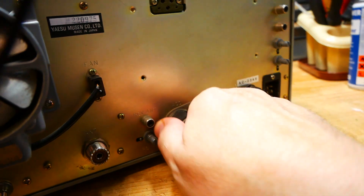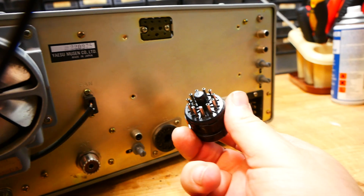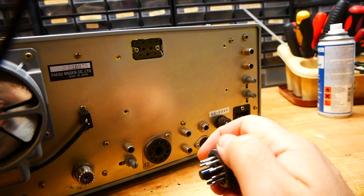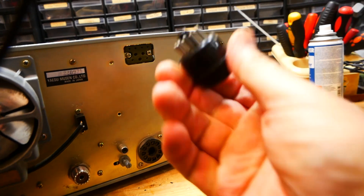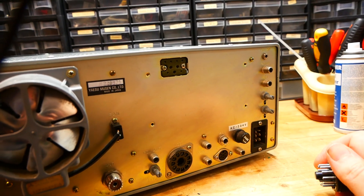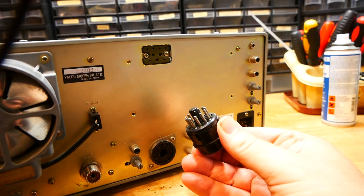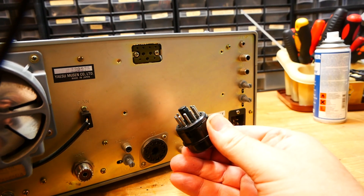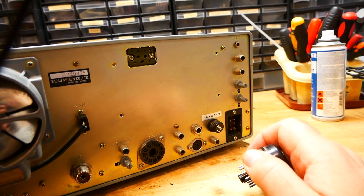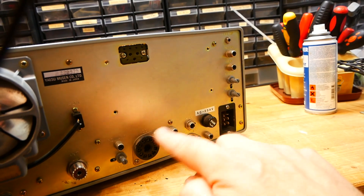You must make sure that it has the 11-pin accessory plug fitted — it's not just a dummy plug. It also shortens two of the contacts to enable the heaters to come on. If you don't have this and there is no bridge inserted here, your heaters will not come on and the rig will not transmit. If you haven't got this plug it's not the end of the world — you can just bridge two of these connectors to make the heaters work. Look it up on the internet; I can't remember which ones to shorten.